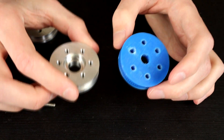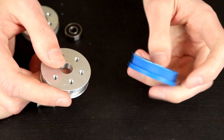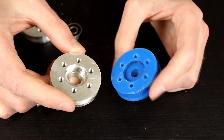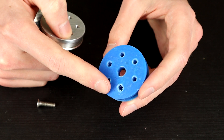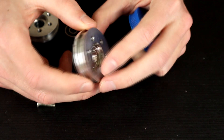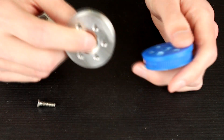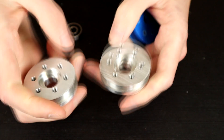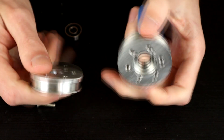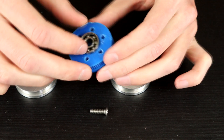There is a significant weight difference between the two pieces — one is solid aluminium and the other is about 30% ABS. That's okay because we previously ran a heavier weapon at around 120 grams, and on this build we'll run a smaller 100-gram weapon. Because of the way the melty works, we won't lose much weapon output power since we still have all that weight out on the edge. The finish on these CNC parts is pretty decent and they feel ridiculously solid compared to the ABS part.